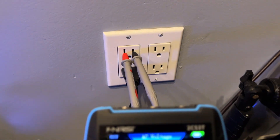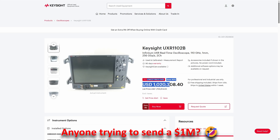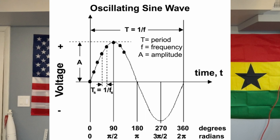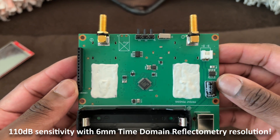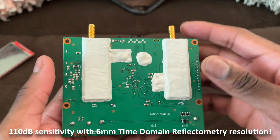What makes antennas impossible to measure with tools like a multimeter is their high-frequency nature. Multimeters are only designed to measure up to a few hundred hertz. Even high-end oscilloscopes lack the sensitivity, and most importantly, the ability to directly measure scattering parameters. That's where this instrument shines. The Vector Network Analyzer, or VNA, is a device with the ability to measure not only the amplitude but also the phase of signals reflected and put through a device under test. These two measurements are known as S11 for reflected power, and S21 for power put through. NanoRFE uses an error-corrected signal generator and receiver system with lab-grade sensitivity to analyze the frequency-dependent behavior of various circuits and devices under test.